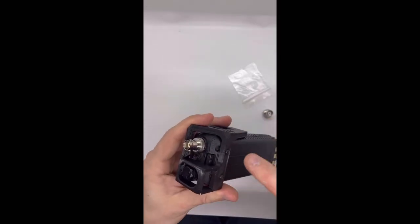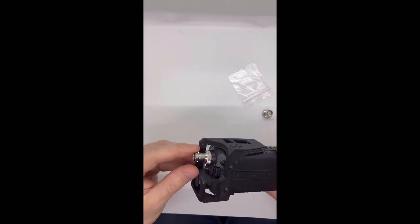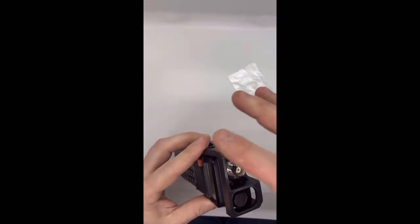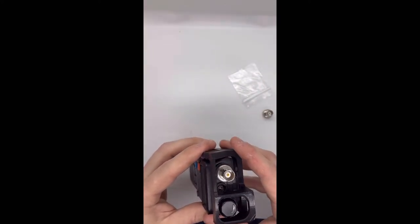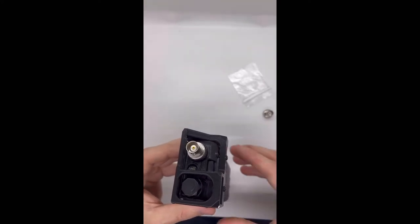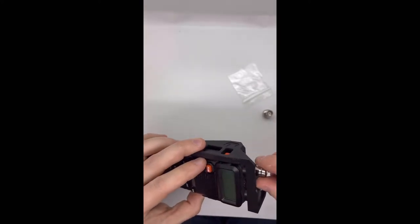What this helps with is when you're moving around a lot in your kit and you have one of these wearable antennas or any other stick antenna attached to your adapter, it'll prevent the adapter from walking away. It's common that a lot of movement can allow the adapter to twist in the direction you don't want — loosening it — and when that happens you'll have a disconnected adapter and be wondering why you're not getting solid communications because you lost connectivity.